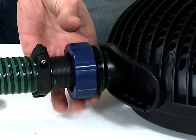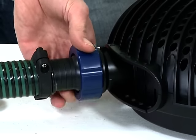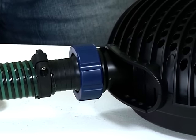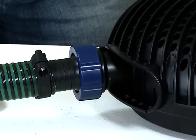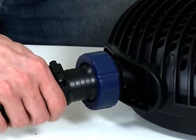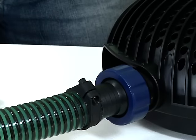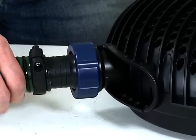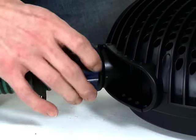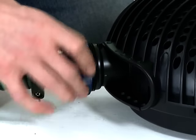Select the desired inlet flow using the graded setting on the inlet distributor. Setting 0 means the pump will only draw through the main strainer casing. Setting 4 means the pump will only draw from the second inlet. If you are not using a skimmer or satellite strainer, ensure the inlet setting is at position 0 and the blanking cap is fitted to the second inlet.